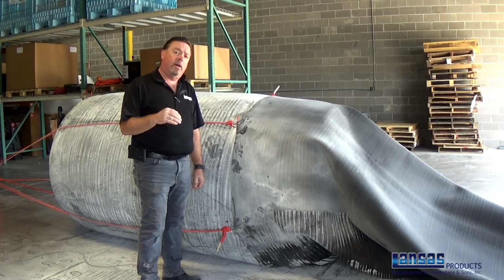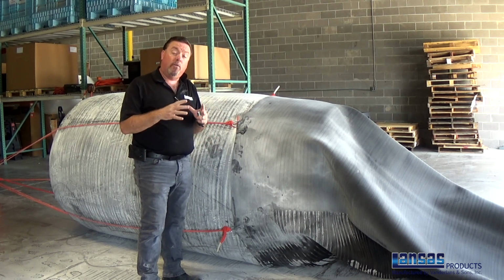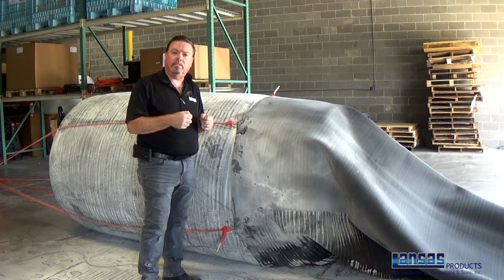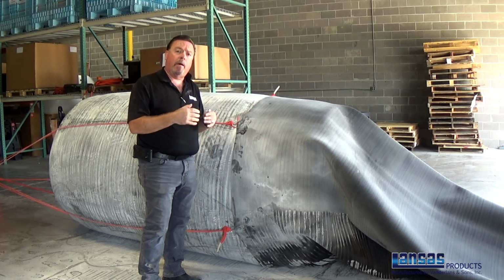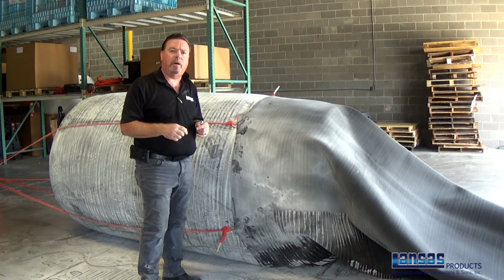Again, not binding up. The next thing you also want to check on when you're putting a sleeve onto a plug is not to have the plug overinflated to where the sleeve is trying to bind because it's already larger than the internal size of the sleeve. So make sure if you need to take the fitting off, let out a little bit of air, give yourself the opportunity to get that cylindrical form to be as close or just slightly smaller than the sleeve to make this as easy as possible.